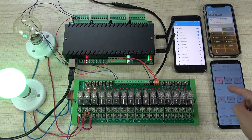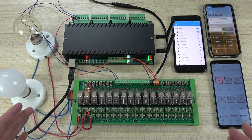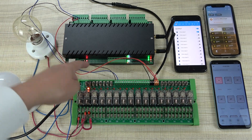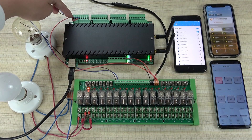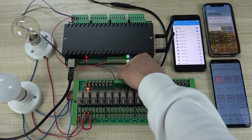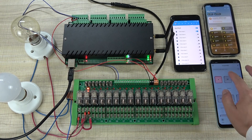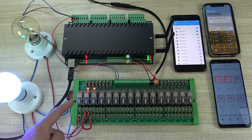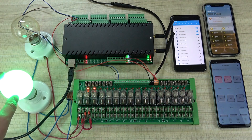You can use a mobile phone to turn the relay on and off — this can connect with large current loads. I have connected relay 1 and relay 2 with 12V. The red wire is 12V, connected to the COM of these two relays, and the output goes to the terminal. When we press the button, the 12V outputs to the terminal, the relay closes, and the current flows through to turn the lamp on.